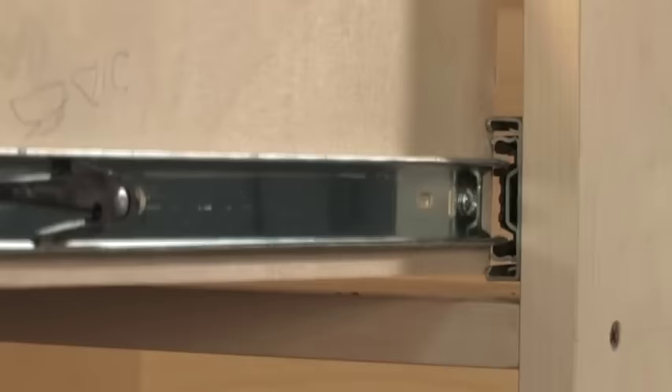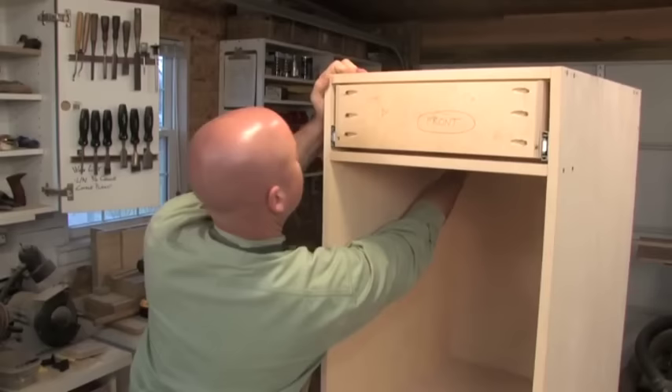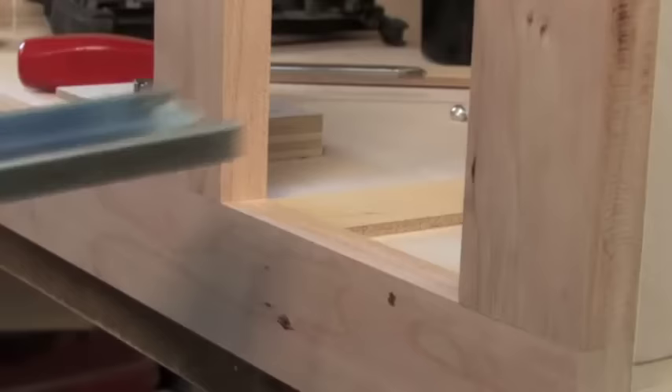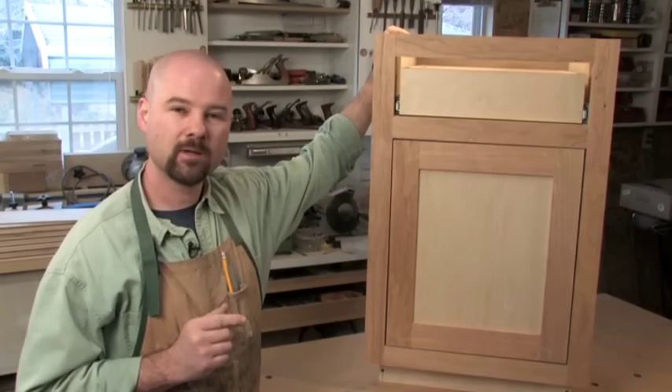The larger portion of the slide attaches to the cabinet side. I use a scrap of wood ripped to a specific width as a locating jig, then just lay the slide in place, drill a few pilot holes, and secure with two screws. Check how you made out — the drawer runners should fit into one another and slide in and out of the cabinet effortlessly. To mount drawer slides in a face frame application, install a quarter-inch thick shim to eliminate the reveal behind the frame, and position the front of the slide assembly at the back edge of the face frame. Then just pre-drill and secure with a few screws. Our doors and drawers are installed — remember to add a spacer to fill the gap in the cabinet in face frame applications.